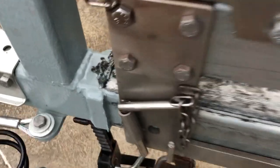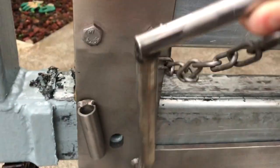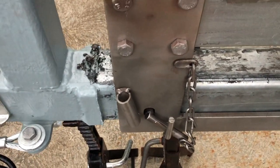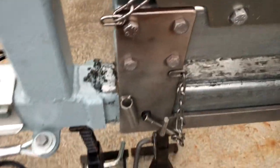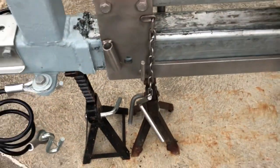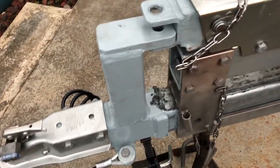Then what you do is there's a bottom pin and a hole — you can actually see the pin, you can actually see the hole. So you take this pin out and you put it in like so, and it would rest just like that. Okay, that's when you pull the whole mechanism out — that's what it would be doing. Take that out, and it has a chain as well, welded. So once that slide tongue is completely out, you just put the bottom pin in, and now these two pieces will be separated, and you launch your boat.